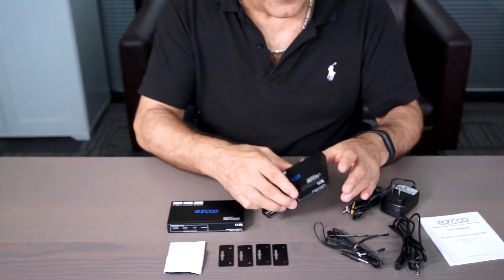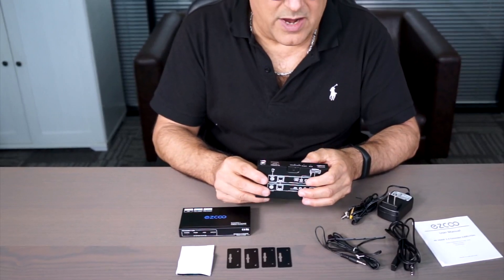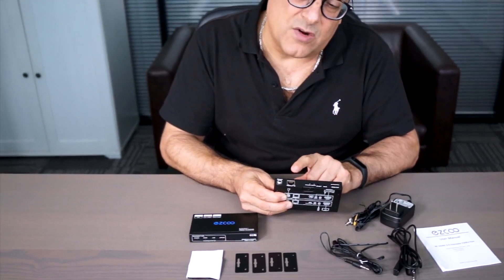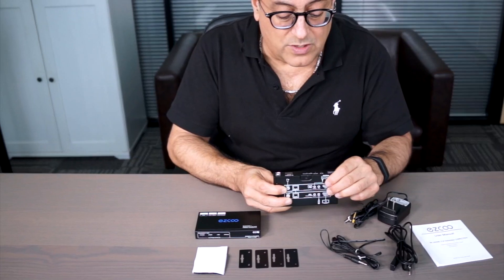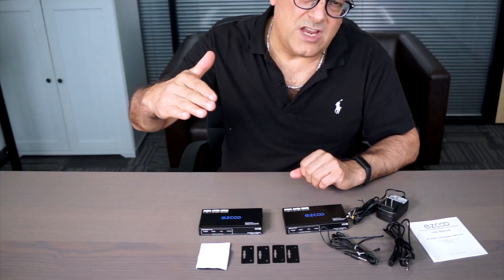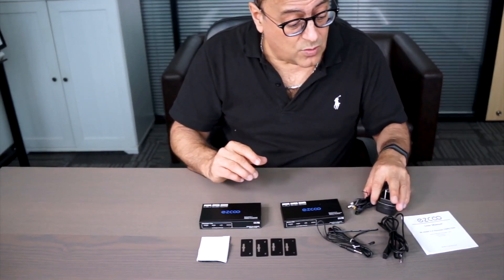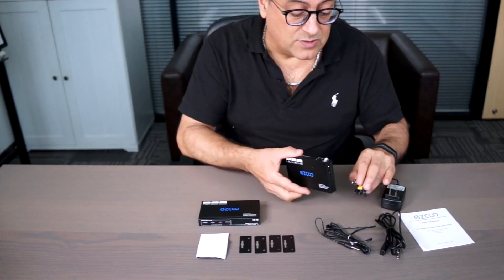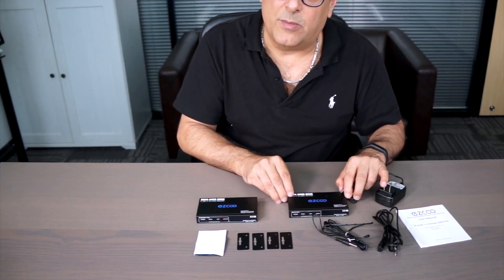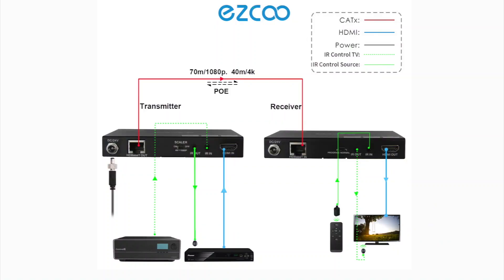In addition, there's a receiver device. The receiver device has HDMI out as well as the IR ports, and you have yourself a CAT 5E or CAT 6 Ethernet port here. You can also change the signal strength from 4K to 1080 quite simply and easily. In terms of power, we have a power adapter that simply goes into the device. And because we're using CAT 5E or CAT 6, we're able to do power over Ethernet as well — we only need one adapter to power the two devices. Very simple, nice design.